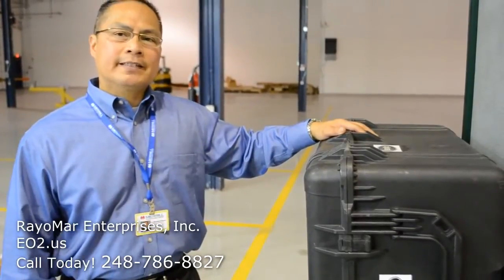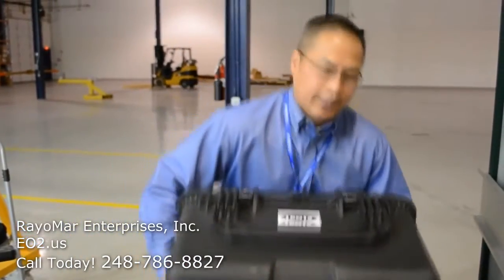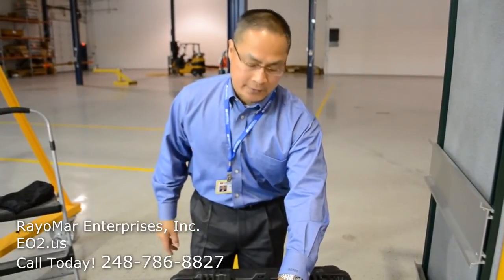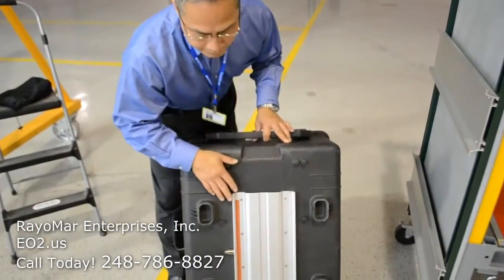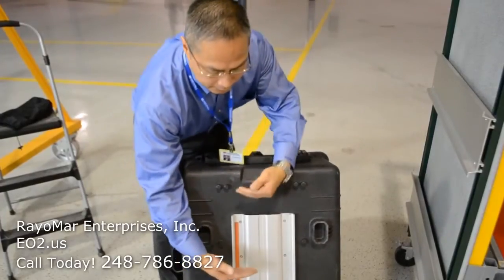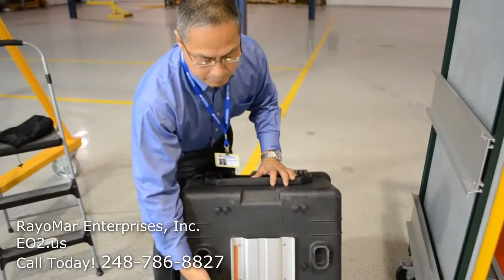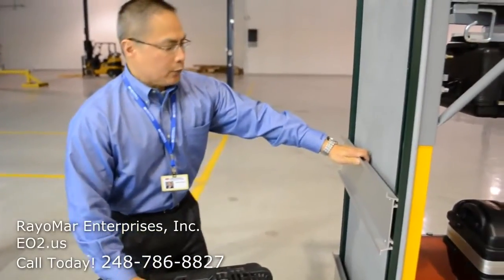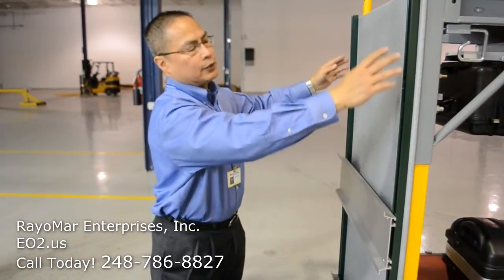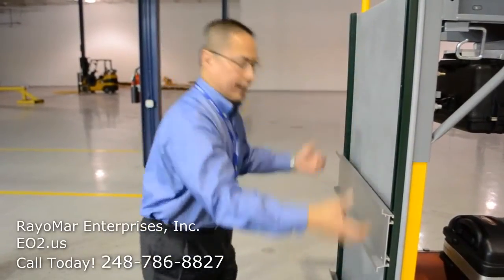Here in a vertical wall mount position is a Pelican 1630 case. It's a fairly large volume case, and as you can see, it's attached fairly securely and easily comes off in that very direct motion that you need to snap off the EO2 Fastener. As you can see here in the back, this is the female section of the EO2 Fastener. Basically, the larger the load, we want to get a little bit longer fastener. We can shorten these depending on the load, and for future applications, it's very scalable in all dimensions. Here also is the lock, and here's the male part of the EO2 mounted on the wall. These are unistrut rails that we mounted on the wall with. We use unistrut rails for wall mounting because you can loosen the unistrut fastening nuts that they supply with their rails, and you can move these rails up and down as needed.